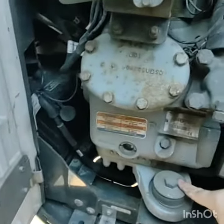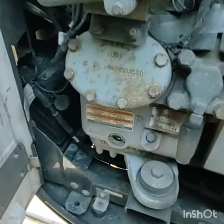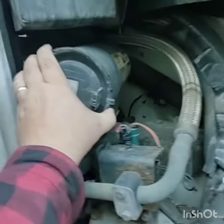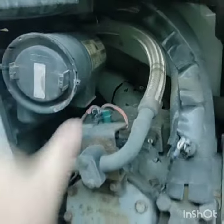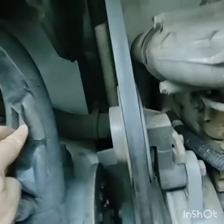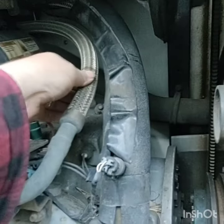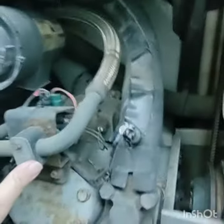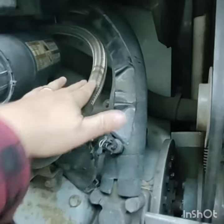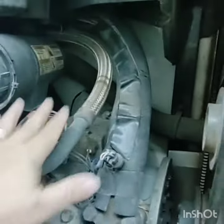Also, there's a rear seal on these things — it's not uncommon for them to leak. What you'll see is something dripping down in the bottom, and it can be oily. Here's your air filter right here — you can check that. This one's zip-tied on because the clamps broke. These vibrosorber lines here are an important component — these things can fail. They're meant to take vibration. It's not uncommon in the summertime for them to build up condensation. Wet with water isn't a big deal, but you don't want to see any oily substance leaking through — anything that could look like Freon, which could possibly be green.